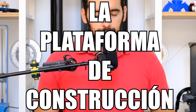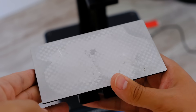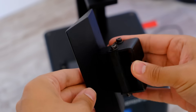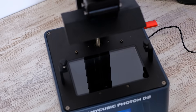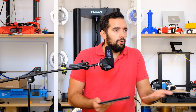Fourth positive point: the build platform. In this case, the build platform already comes textured with a jewelry pattern effect that when I read it in the Anycubic link it seemed like a gimmick, but it is true that it is very good — the pieces adhere well and above all they come off very easily, which is what I liked. Above all, when it is attached with its four screws, the base is much more rigid. Previously Anycubic had the typical system of two screws — front and lateral — and it was very easy that when removing a piece you would release the base and have to recalibrate. I did not have that happen once, so it is a very solid base.